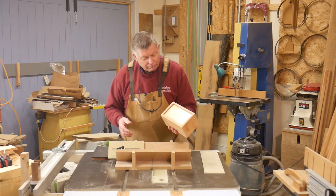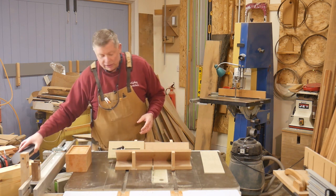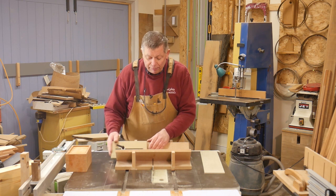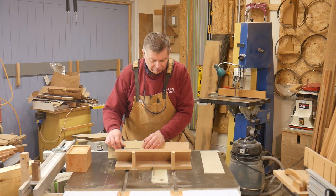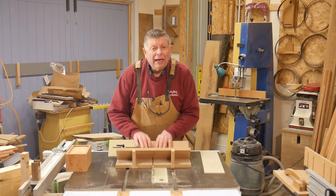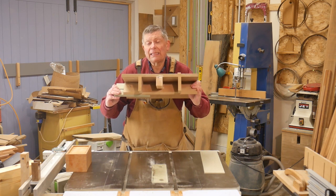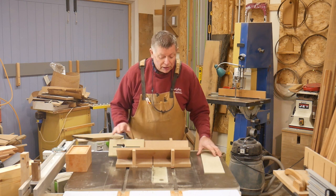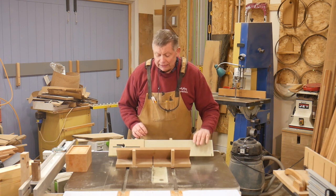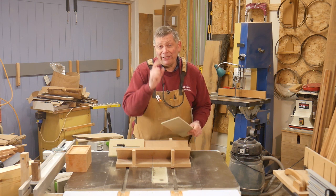I've got a jig, of course, and I call it a deluxe cross spline mitre jig because it's got a few nice features. It has a very robust fixed stop that slides left and right, and a guard so that when it's furthest forward and I'm holding things here, I can't touch the blade. It's also deluxe because it's zero clearance — achieved with a piece of scrap that goes in there. If you do decide to make it zero clearance, you must remember to actually use it.